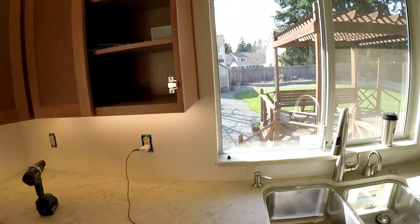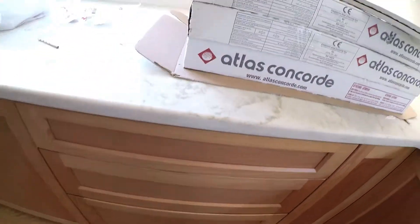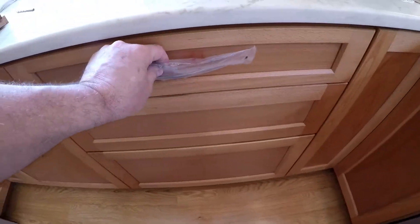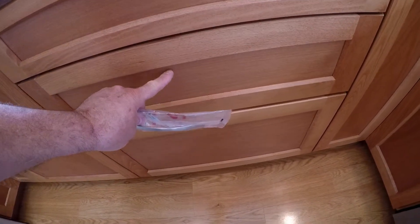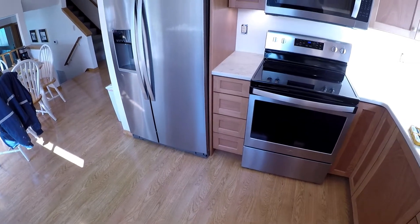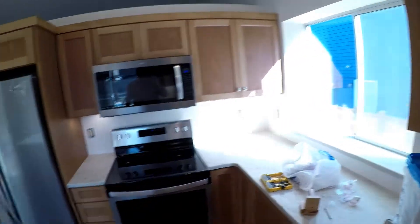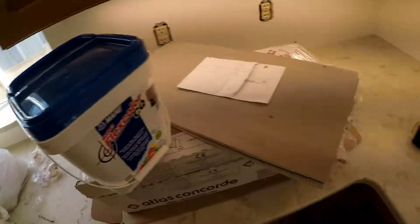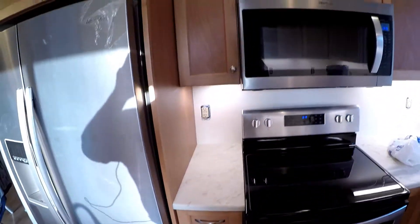That's an easy way to do your knobs. I still have to make a little jig for the cabinet door fronts where we're going to put in the drawer pulls. Remember, these match the appliances. These are all going to go about the center of the small cabinet, and it will maintain the height down from the center on all the other different sizes of door fronts. We're just going to install all the door pulls at the same distance down from the top.